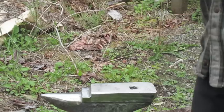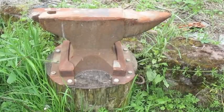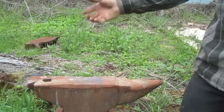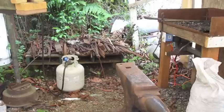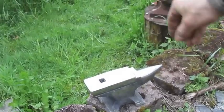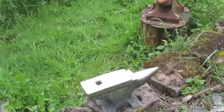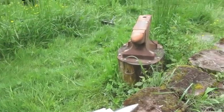Testing out the rebound with a ball bearing — to me it seems about 75-80% rebound. This here is a Vulcan cast iron base anvil with a steel face on top, similar to the one I just made — about the same. This here is a Fisher — these are really good brands. It's a cast iron base with a very thick steel face, and this one's about 90-95% rebound. This here is my Hay-Budden 100 lb anvil, about 80-90%. And back to the one that I just modified — real good.